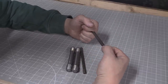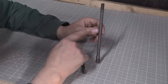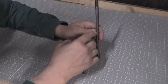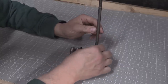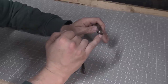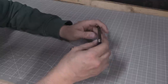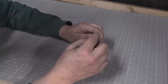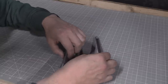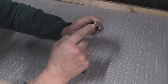And tensile strength, or tensile, basically, anytime you're pulling anything, what matters is the cross section, right? So if you cut this, you'd end up with a diameter, you know what I mean? Obviously not that size, but you'd end up with a diameter. And it's that diameter that matters, right? Because it is that area there that's resisting the pull. If you make this fatter, like this one, there's a lot more diameter,